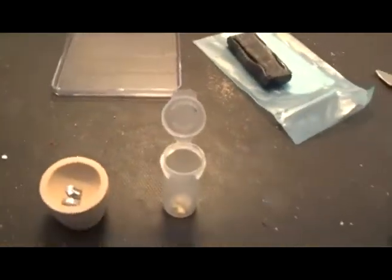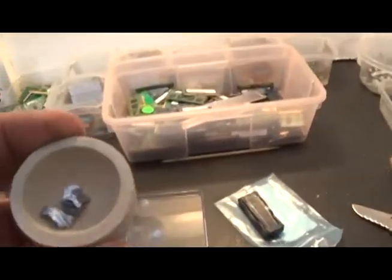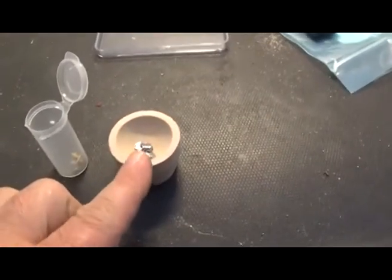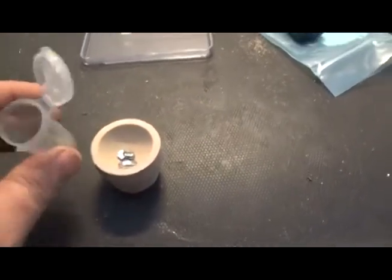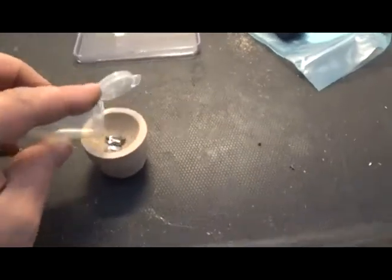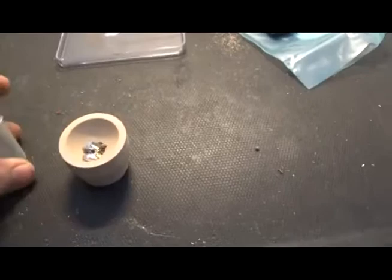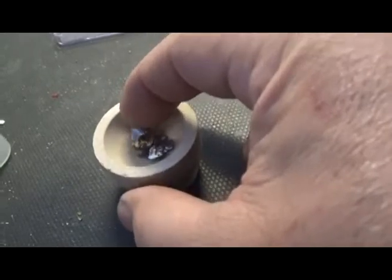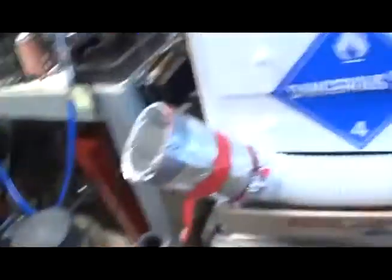We'll pull a few of them out. We're going to use this cupel. Now just measure these out in equal parts — 1.24, 1.28 grams of lead. It's what we have here in gold. We're going to add this together and stick it in the furnace, and we'll get it all coalesced into one nice button. Hopefully. This is a pretty simple exercise. Turn this thing on, let it get to 2,000 degrees, let it set for a second.